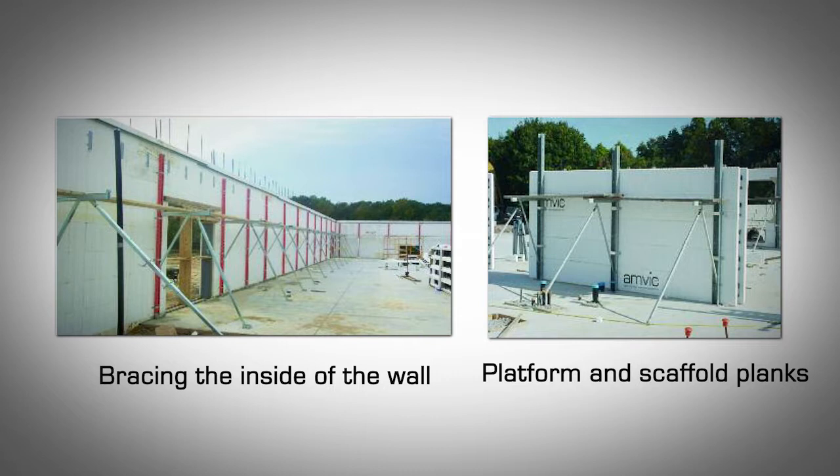While generally you brace only one side, if you have a wall section that you cannot plumb any other way, you may need to install braces on both sides to properly align the wall. Most bracing and alignment systems are specifically designed to allow for placing scaffolding, planks, and installing handrails. The planks and handrails are usually provided or acquired separately.